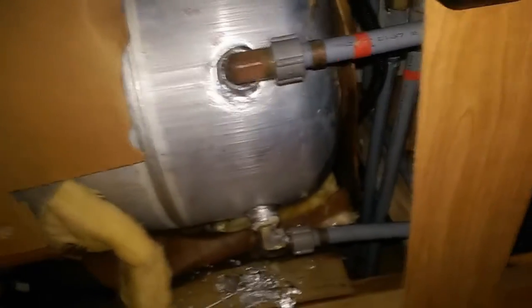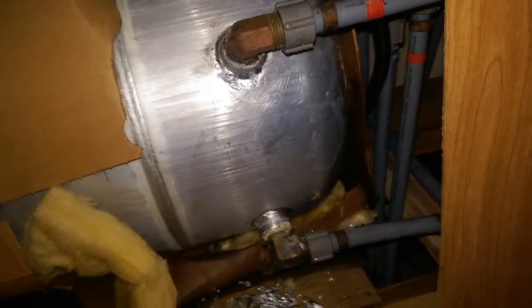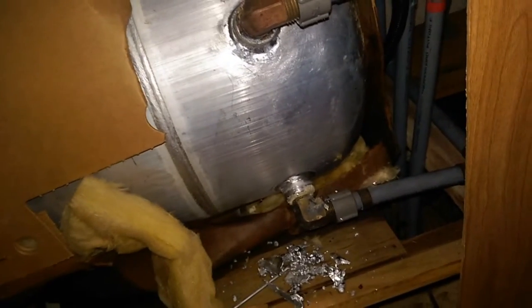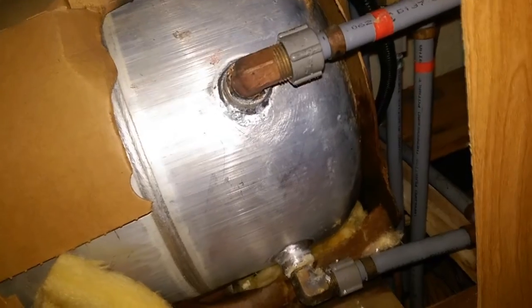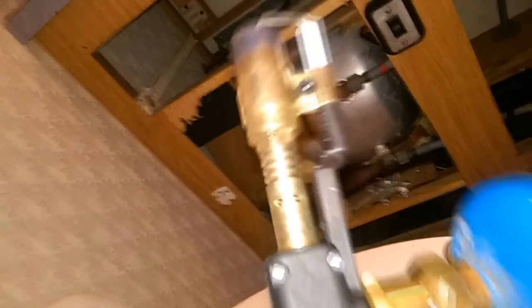It's really cold over here — about 25 degrees. If your propane tank is really cold, it's not making the same amount of pressure that it would at, say, 70 degrees. Whenever I warmed up my propane tank, it put out more pressure, and more oxygen was able to mix in with the gas because of a venturi effect on the holes around the nozzle — those holes draw in air.